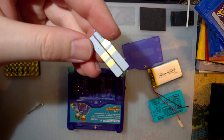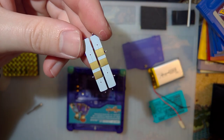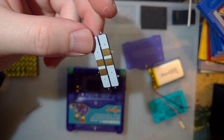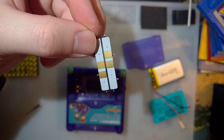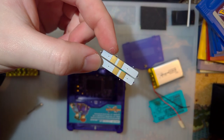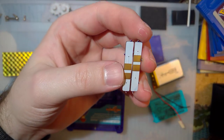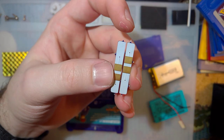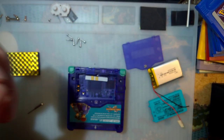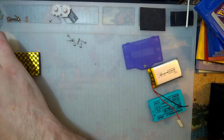That's where this comes in. I just quickly sketched and designed up a PCB in KiCAD and sent it off to OSHPark. Unfortunately, it did not meet their minimum size requirements, so I literally hit Ctrl-A, Ctrl-C, Ctrl-V and got two of them instead. So instead of just ordering three of these, I now have six. But like usual, they do come paneled — not paneled, but they make them with these breakaway tabs, so you have to file that off. I've already gone through that trouble on this one here, so we don't have to sit here and watch me file these away.